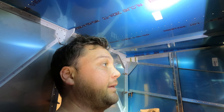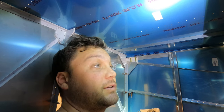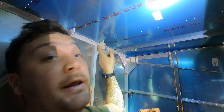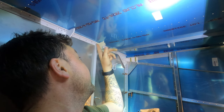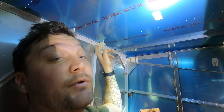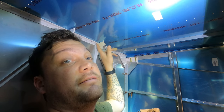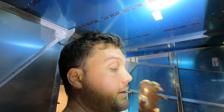It's a little cramped in here. One of our rules of building airplanes is no sharp corners — we're going to make a cutout for a stiffener, and we want the corner of that cutout to be started with a drill bit and have a round radius corner, as we've done throughout the build. But it won't fit unless the corner of this is also rounded. I wish I would have known this six months ago — I would have put a slight radius on this when it was ten times easier. But right now I've got it taped off and I'll be able to nick the edge of this enough so we can put a corner on the notch we're going to cut out, and they should nestle together nicely.